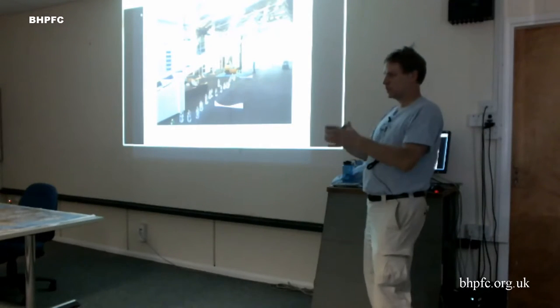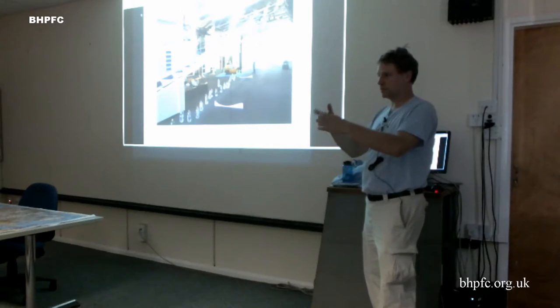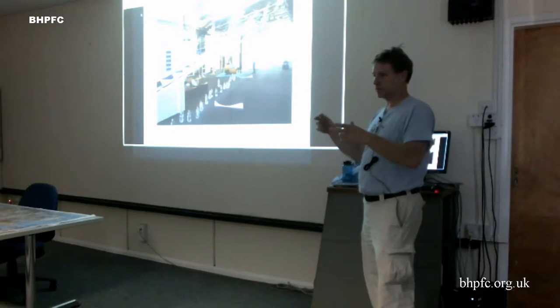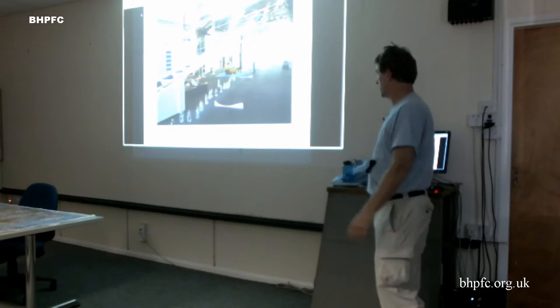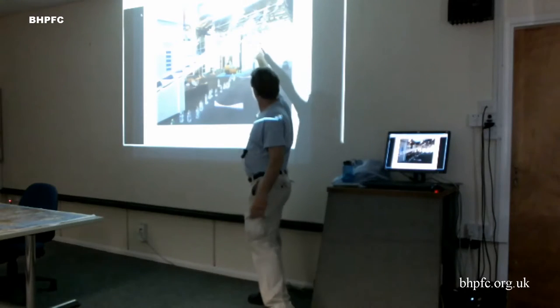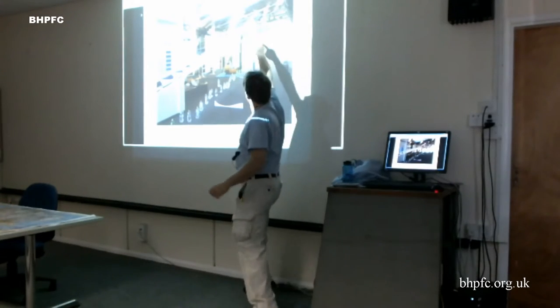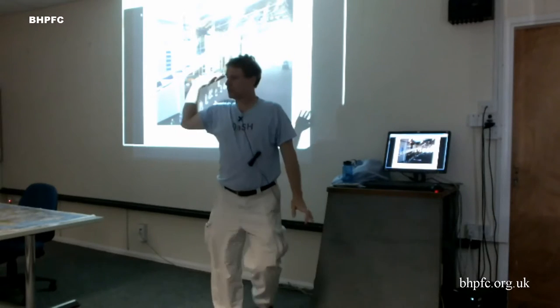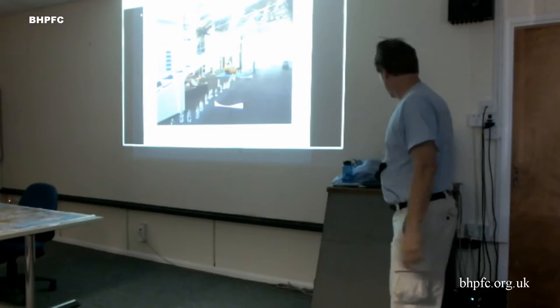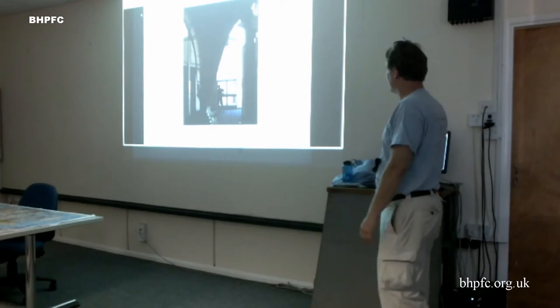And the safety cord was because we had a one-point system for lifting it. We didn't have 2 points because we wanted to sort of simulate the way it was really being suspended and not have an artificial torque put in there. But what that meant is that on this aluminum pseudo-fuselage thing here, it was just the friction of that tube that was holding the whole thing from rotating. And we had the safety cord tied from here to here that was going to prevent it from rotating away. And we took it away, and then the next day I was like, well, that worked so well and didn't move. I'm not going to tie the cord back on.